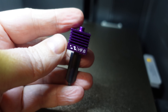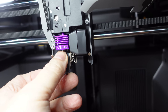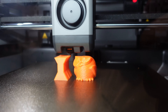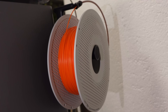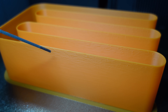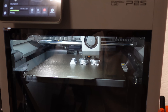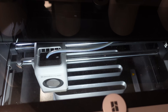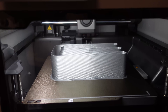And now the last nozzle change in this video — same G-code for the 0.6mm nozzle. One more minute and it will be finished, and it looks completely fine. Look at that flow rate! Hardly noticeable, but I can see some minimal signs of under extrusion here on the top. Last test object from PETG with the E3D 0.6mm nozzle. Finally the last flow test. The most annoying thing is that this kind of printing must be supervised. But this time it was finished correctly.